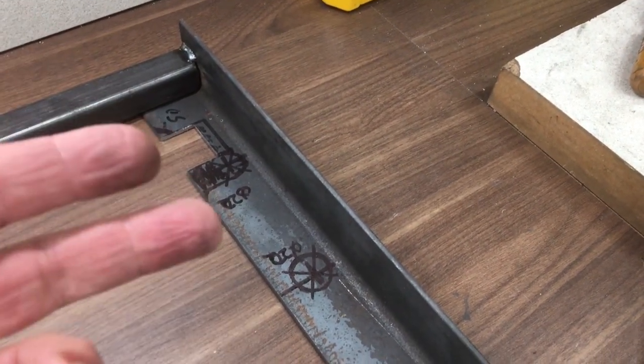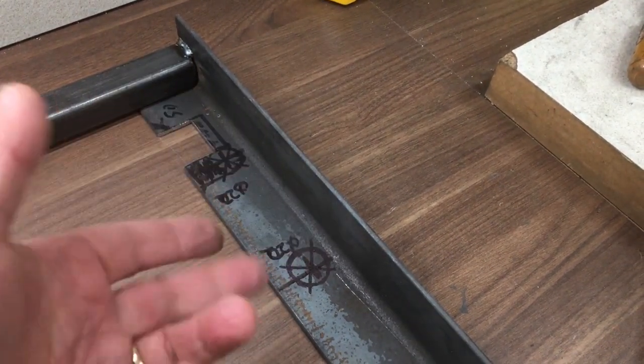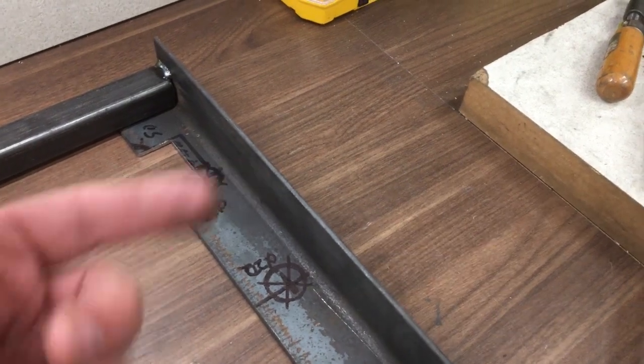I'm now making this instead. I've just got a little bit of the offcuts of the angle iron I used to make the battery frame — that's 50×50 angle iron, with a bit of 25mm box section added at the front and rear. These cutouts are because there's some box section that goes underneath the battery frame, so I need to cut those away. Then it will basically drop and sit in here, and this will stop it coming off the front or going off the back. I've just got it tack-welded in position. I've still got to take out a hole there and a bit more of a cutout around there.